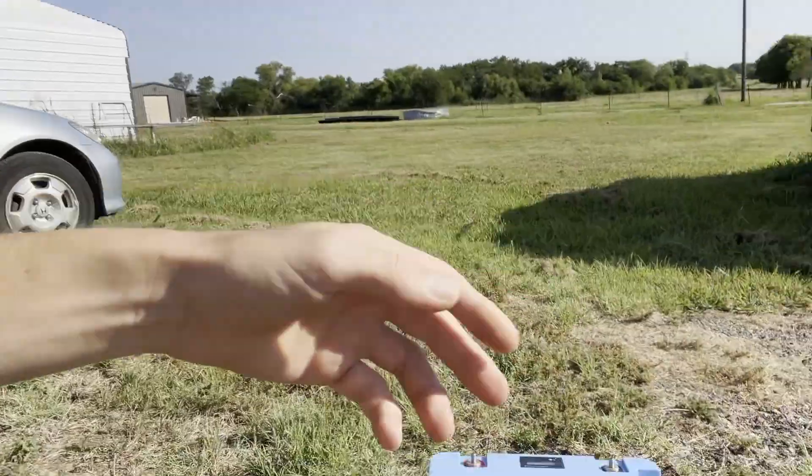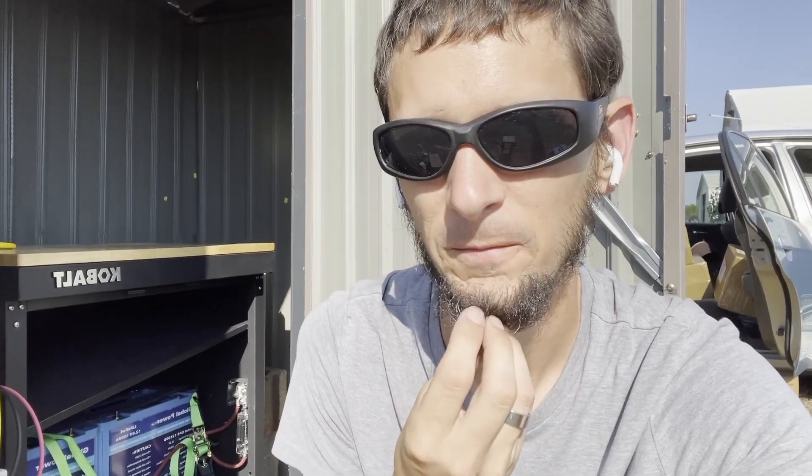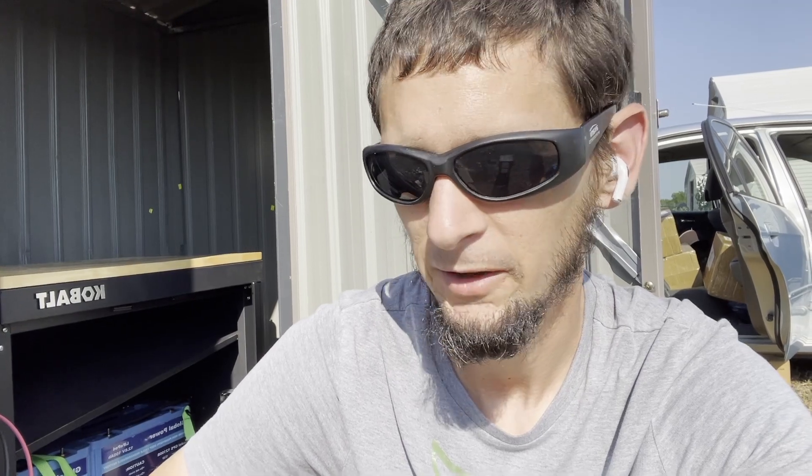On these blue batteries, you've got the voltage screen. I said we'll go hit those and see what they show. Well, one of them doesn't show anything, and that screen is connected directly to the cells — it's not going through the BMS — which means something is dead dead inside the battery. But it seems like the BMS is allowing power through, which is very odd. You would think it would have cut itself off from the rest of the series string, but it seems like the BMS may be shorted internally.